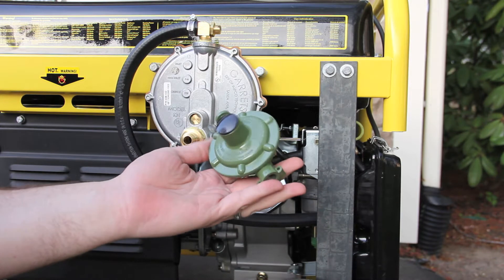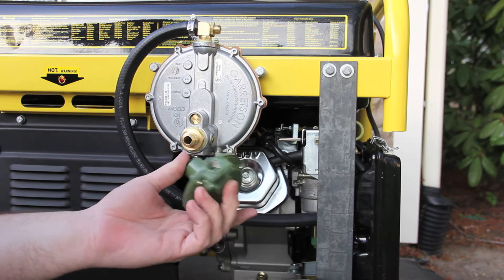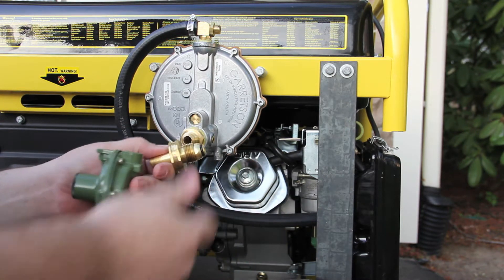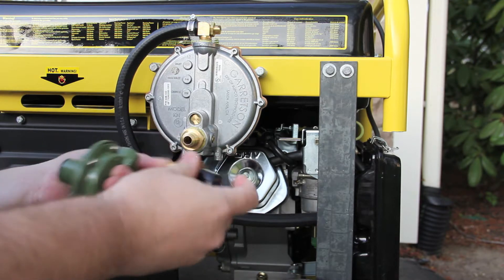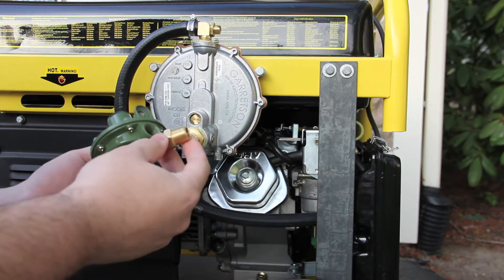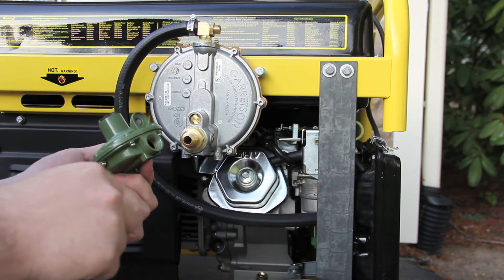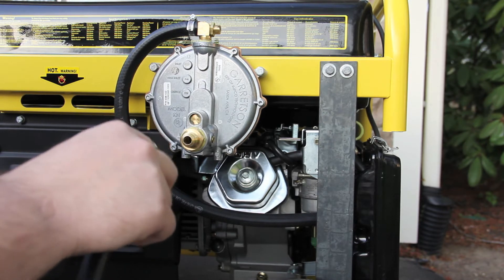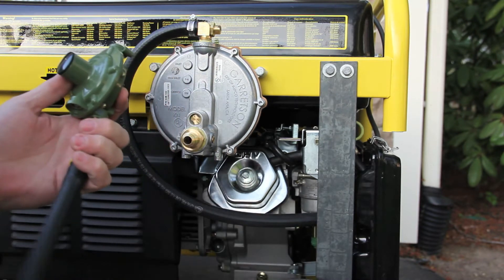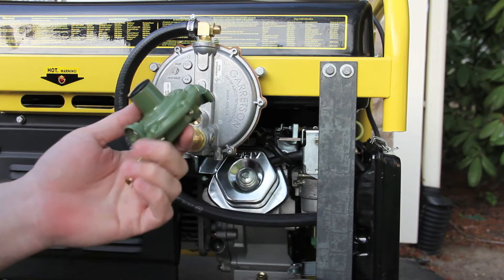The next thing that I want to do is work on this regulator. This is a pressure regulator, and you can see here it has quarter inch threads on this side and this adapter, which actually screws into the actual propane tank. This is just a cover to protect that. So I'm going to put a little pipe dope on here and tighten it up. And then on this side there's another adapter that's half inch that I'll screw in here. I have to put some pipe dope, and once it's on there, the hose will attach here like this. And then the other end of the hose will attach to the on-demand regulator.